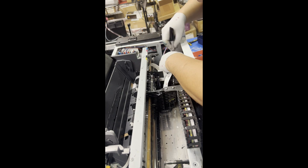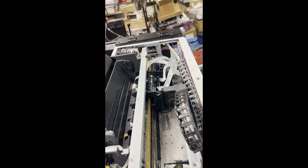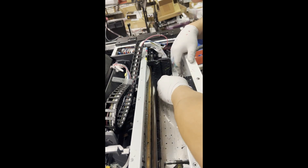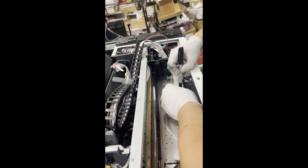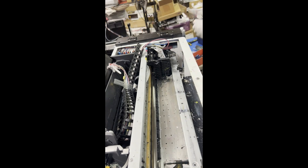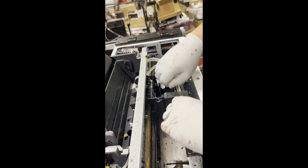Now I'm marking on the bottom end where the three holes are — you don't need to screw all three, just one screw. With the same drill bit, I drill through the metal. I take the drag chain away, put the bracket in place according to my markings, then mark the center point of the bracket — there's already a hole there. I make two more holes and then use machine screws to install the two brackets. I lay the drag chain on top of the brackets, insert them, and install the last machine screw.